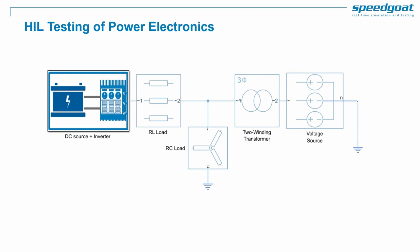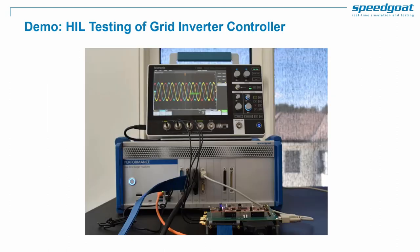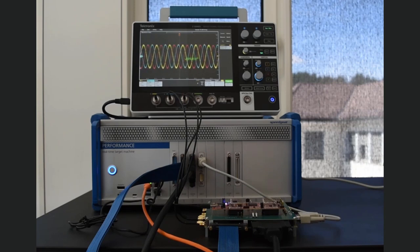Today, as an example of HIL testing for Power Electronics, we will consider a grid-tied inverter system and show how to perform testing for a three-phase inverter controller. We use a real-time simulator running the power converter on an FPGA, and an interface board to connect to a microcontroller — a C2000 LaunchPad from Texas Instruments. The simulator emulates sensor signals sent to the microcontroller as analog inputs, and we send reference values to the controller via CAN. With this test setup you ensure that power electronics controls run stably and you can safely emulate many scenarios such as faults.